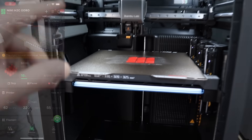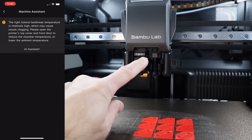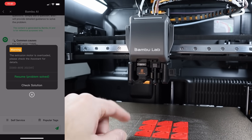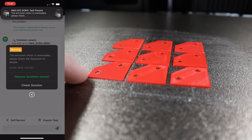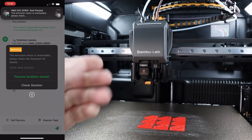At 55 degrees Celsius chamber temperature it did not work. It did give me a warning in advance saying the temperature was too high, and then eventually it said the motor was overloaded and I had to stop the print. This is how far I got into it. I need to clean this up and try the next one at 50 degrees to see if that will work.